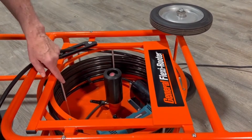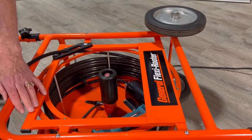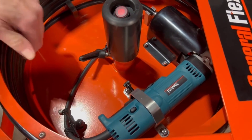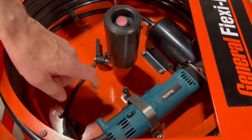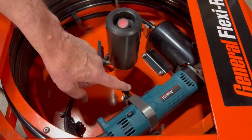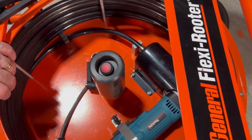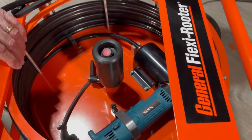The power button is right there in the middle — turn it on and it lights up, turn it off and it goes out. We have a brake here; it's a ratchet-style brake. When it's on, it allows for easy transport. I'm going to loosen it so I can turn the reel. We have a speed control right here — tighten it and the speed goes faster, loosen it and it goes slower. And then we have a slip clutch, which is designed for safety and to protect the integrity of the flexible shaft, making it less likely you'll break something.